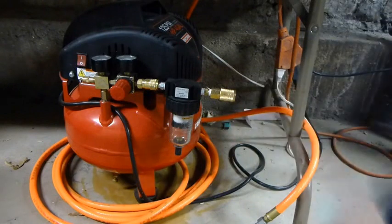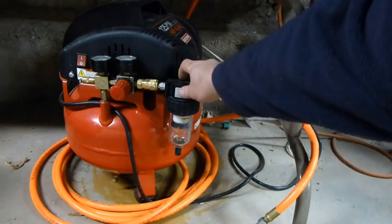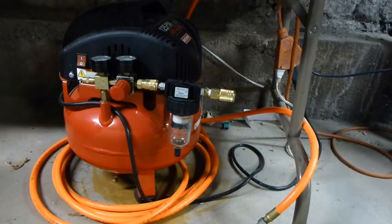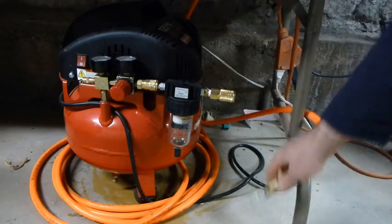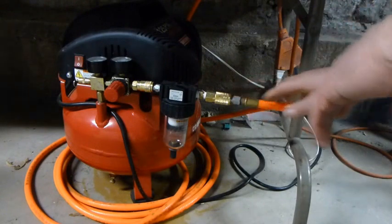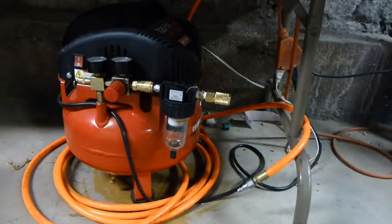You can go with 50 or 25 feet. Use as much hose as you want, but use at least 25 feet of hose. Then I got a water separator here. Good news is I've never gotten any water in that separator. I run my input at 90 psi — I set this up to put out 90 psi air. I hook that into the shoebox with the hose.